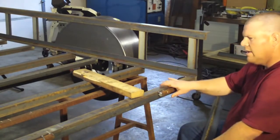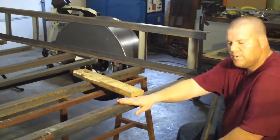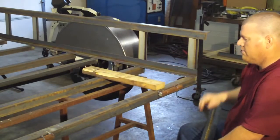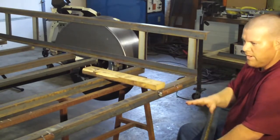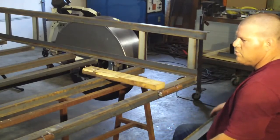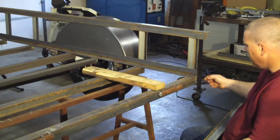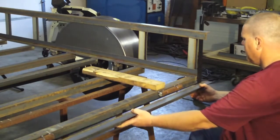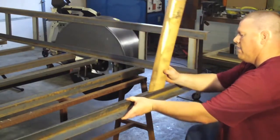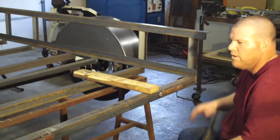Now these hinges work great if you're putting plywood or flat steel like I'm doing. This is the way to go, in my opinion. But there is a possibility that you're going to want to use 2x4s. Now, if you want to use 2x4s on both the ramp and the tailgate and the floor, you're going to need to probably do what I talked about. Some trailer manufacturers put this piece of flat iron out with a hole in it, and you're going to need this hinge a little bit further out. That way, when you fold it up, your 2x4 has some clearance here. I can't cover every single case, I'm trying to point out the problem, I guess.